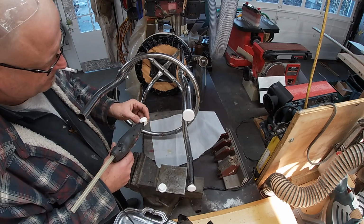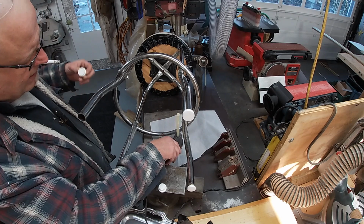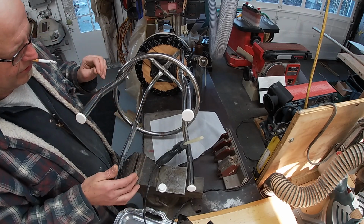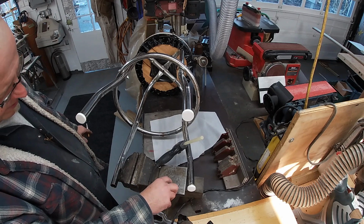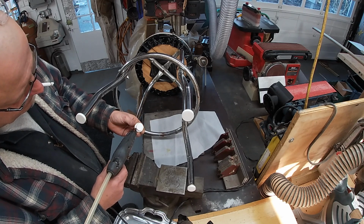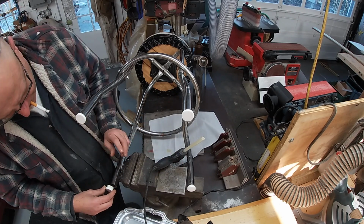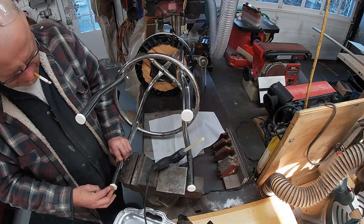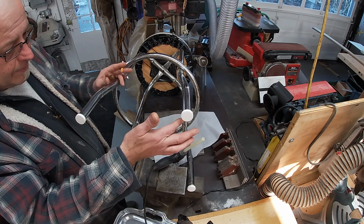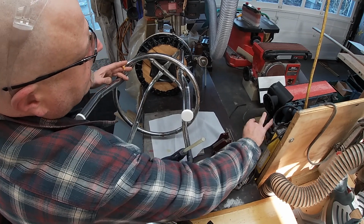with heat. Shocking, right? It melts at a lower temperature than wood. So if you're gluing two pieces of wood together and you want to eventually get them apart, you can heat them with a heat gun, pretty much to the point of smoking, but you can get it apart if you have to. And it's quick. I could have used CA glue on this, but CA glue gets real hard. Hot glue always has a little bit of flex to it. And if you know anything about glue, a little bit of flex in your glue, depending on what you're gluing together, obviously, isn't a bad thing.